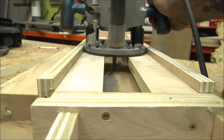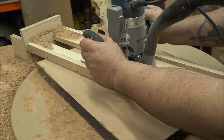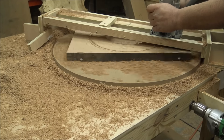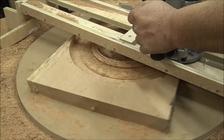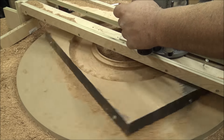This is really just the first step in what I want to do with this turntable — I'm going to do a lot more in upcoming videos. I wanted to play around with this system a little bit more just to see how it could work with this really simple sled over the top of the turntable. One of the things I did is dig out a large bowl in the center of it, and you can cut out circles with this as well. I also mounted the slide at a bit of an angle and created a taper going from the outside to the inside, creating a kind of weird edge on the bowl. And of course you can always mount the material off-axis and do some cool decorative work with it as well.